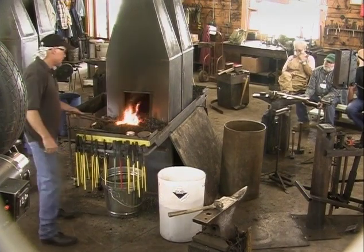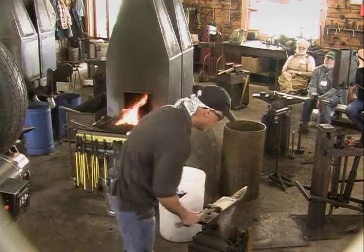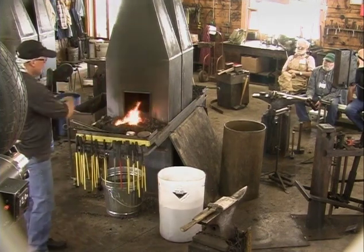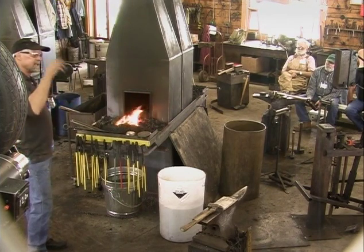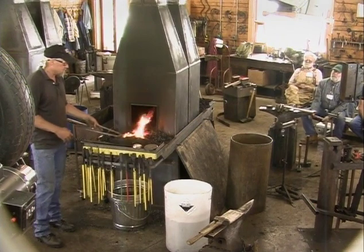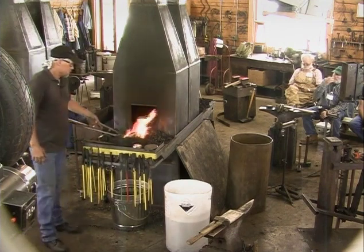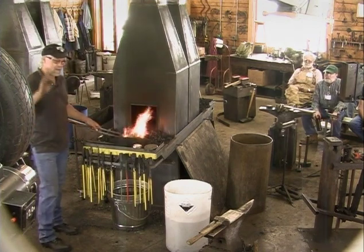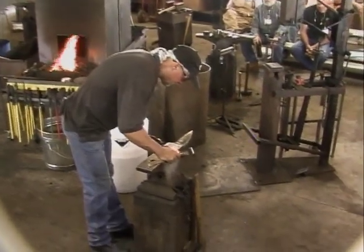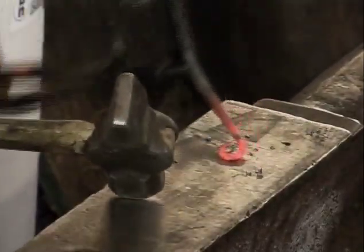Now you know it. When I was in England, they take great pride in not using flux, and that's fine. They use what they call metallurgical coke or breeze with the side blast. They don't have a fire pot, just a big water-cooled bosh. I thought that heat was so clean and intense that it was not a problem to weld without flux. But what I saw was because they didn't use flux, it would take them 2 heats to make a weld when I thought that should have been 1. Francis was pretty big on doing all the prep before the weld, and when you're done with the weld, it should be done. The piece should be done on that part of it. It doesn't always happen. But in England, they kind of intentionally went into it thinking it was going to take 2 or 3 heats to finish a weld. It surprised me after being around Francis.